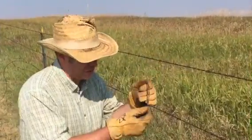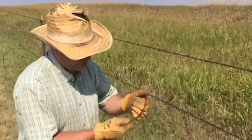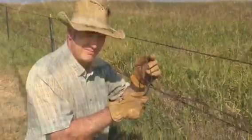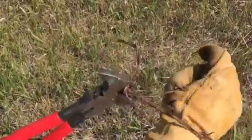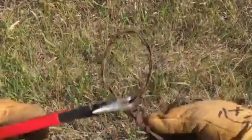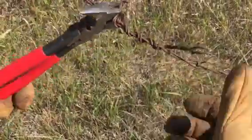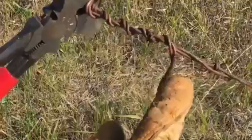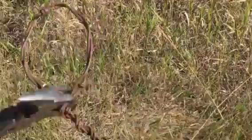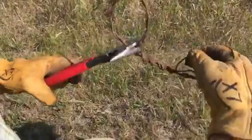We're dealing with barbed wire that is probably 65 years old, so when you're dealing with wire that old, make big loops. You're gonna want a big loop — otherwise if you kink that over too much it's gonna break. Some people think this looks sloppy, but you know what you're doing. If you twist it tight, that wire is gonna break. It's already starting to break — yep, it just broke off.